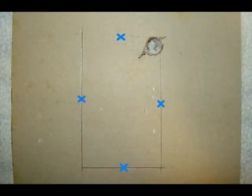If you're using a hacksaw blade, you will need to drill a hole within the lines at the top of the box so you'll have a starting point for your blade. Disregard this step if you're going to use the drywall saw shown in the photo previously. If you gently push and slightly twist the drywall saw where the X's are marked, you'll be able to start your first cut.